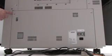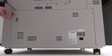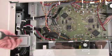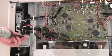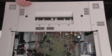I'm going to need to remove this rear panel, so I need to disconnect the USB cable. The rear cover has two screws on the top and two screws on the bottom — I'm going to get all these cables out of the way. In order to connect the sorter, I need to remove the cover over the plug; that has two screws. To install the top ejector unit, I need to remove the five screws from this cover — I'm not actually going to take the cover off, just remove the screws.